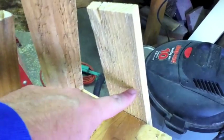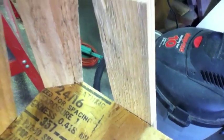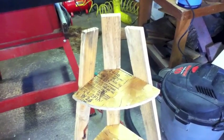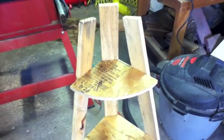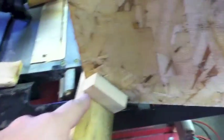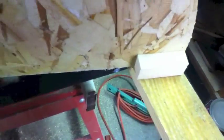I thought about leaving the legs sticking up a little to give a backdrop look, but I don't think I'm going to like that. My plan is to run these over to the bandsaw and knock them off level with the platform — if that doesn't work I might use a hand circular saw or a plain hand saw. The shelves are supported by three little glued-on blocks of scrap wood. The boards I use for the uprights in the final version will be thicker, and I'll cut rabbets or dados into the legs.